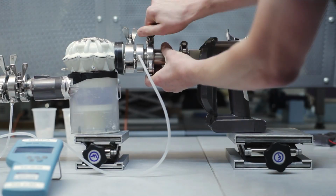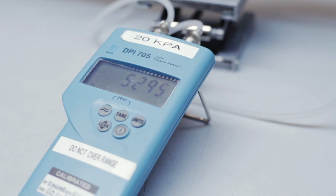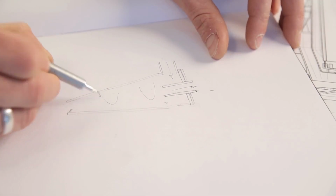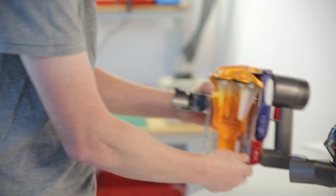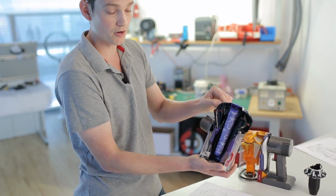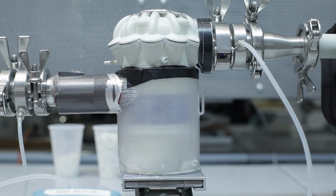For the new Dyson Digital Slim, we wanted to release as much flow rate to the cleaner head as possible to maximise the pickup. In order to maximise the efficiency of the cyclone pack, we can use smaller cones. Due to their smaller diameter, we get higher G-force and therefore improved separation. On the previous Digital Slim, we had 6 cones. On the latest product, we've actually got 15 cones, 10 on the lower layer and 5 on the upper. More cones means a less restrictive cyclone, so more product flow rate.